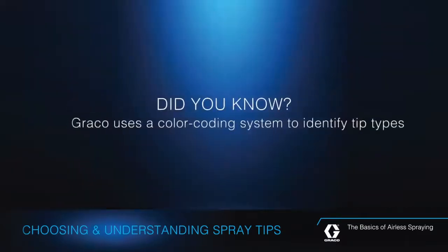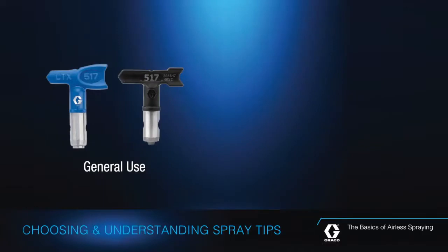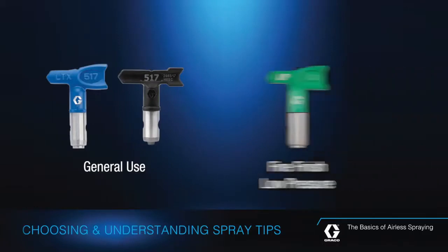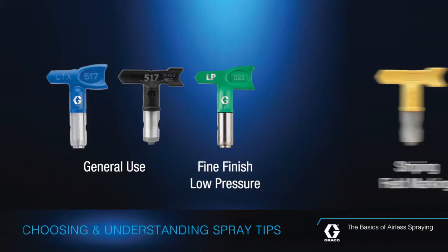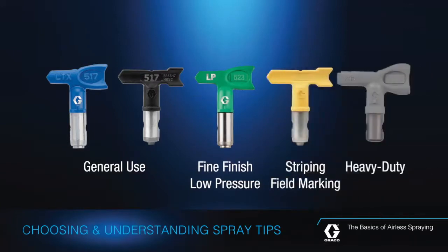Graco uses a color coding system to identify tip types. General use tips are blue or black. Fine finish or low pressure tips are green. Tips for pavement striping or field marking are yellow. High-pressure heavy-duty tips are gray.